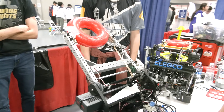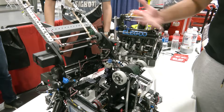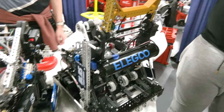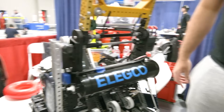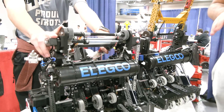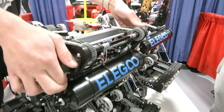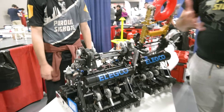We also have a fold-down feature. With that size constraint, we started with our 24-inch robot and found a geometry we really liked. But when transferring that to the 15-inch robot, we were just a tiny bit out of size. In order to maintain the same geometry and start the match in size, we have two pistons here that will pop the Lady Brown mechanism up, ensuring we get the proper geometry that we had already thoroughly tested.